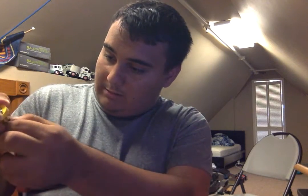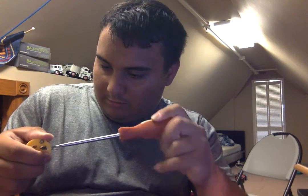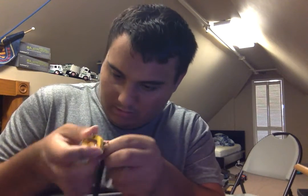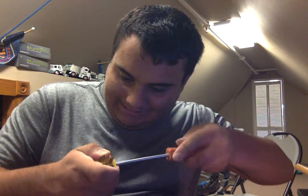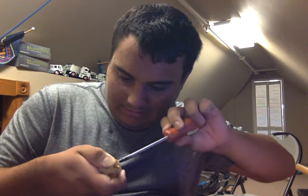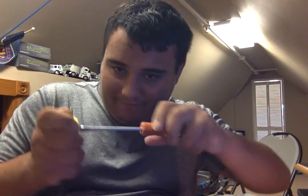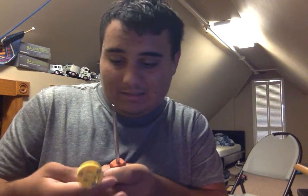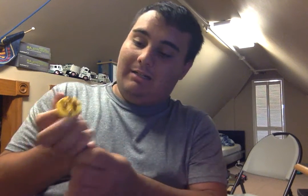When you insert, you don't want any exposed copper head — you don't want any exposed copper at all. And when you do this, don't be afraid to add some torque because you do not want this coming loose. The ground is connected with no exposed copper.